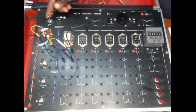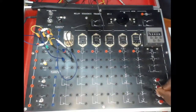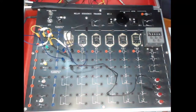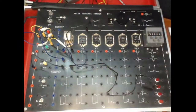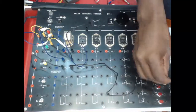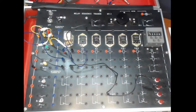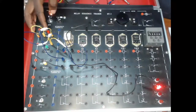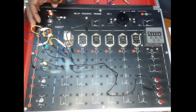Now for me to show that, you can barely see what is happening. For me to show that, I'm going to power one of the indicator lights so that you're able to see what is happening. So we're just using the same relay connection which we are going to power as like so, and then from there we power to the neutral. So once we switch it on, once we start, we've got the light indicating we can stop. So the holding on contact is working, and so on.